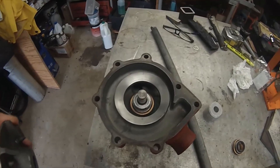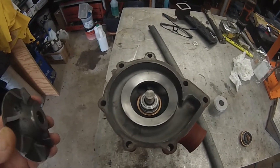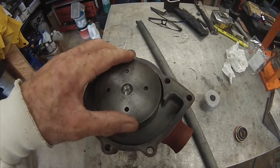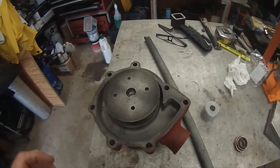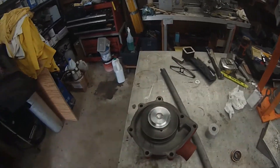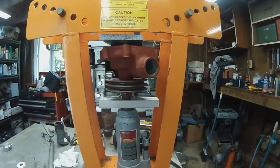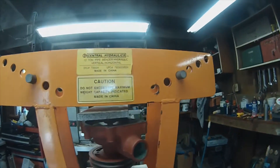Here's the wheel we're going to put on. I wiped the grease off of the shaft because it's supposed to be a dry fit — a nice tight fit. We're going to place this on and put that in the press. We may need this part here that I made to pick up the clearance. Okay, this is the most important part up to now. We're going to press this on and make sure it's lined up pretty nice, then give it a go.